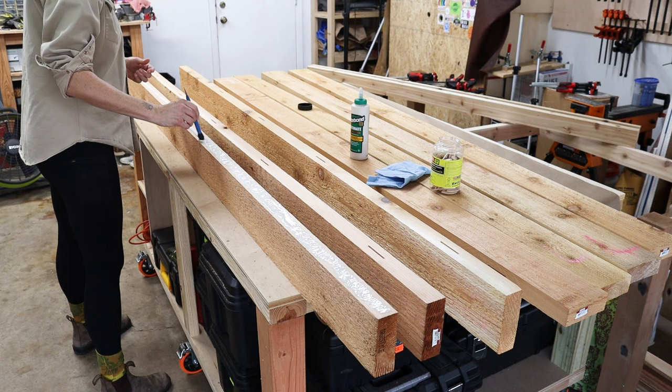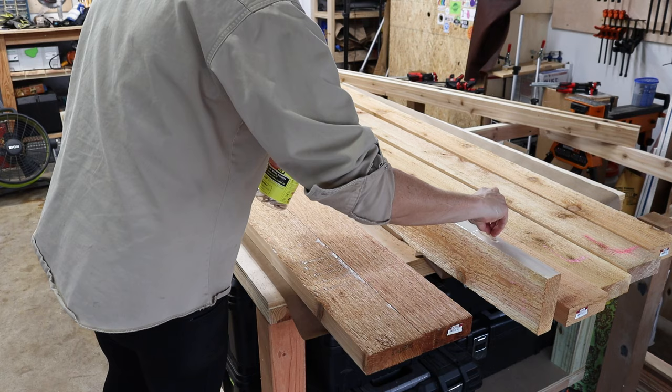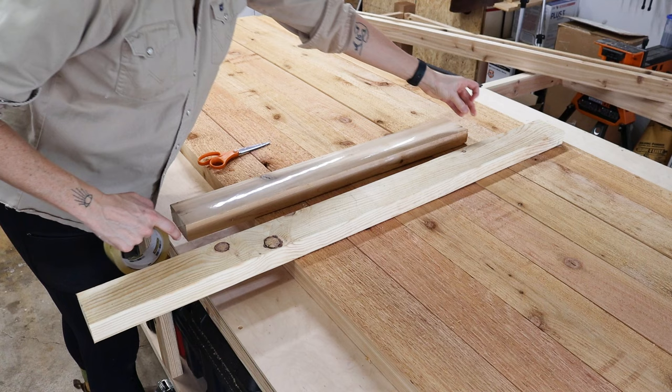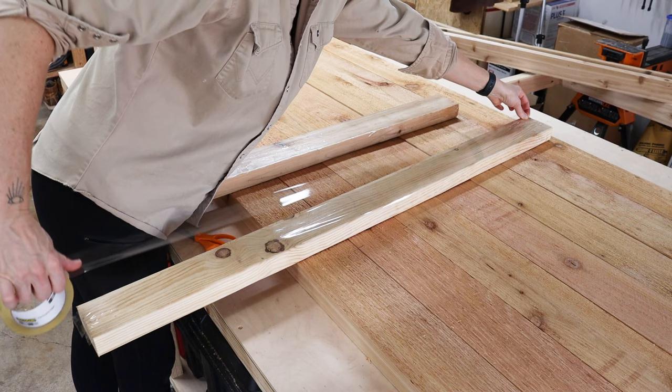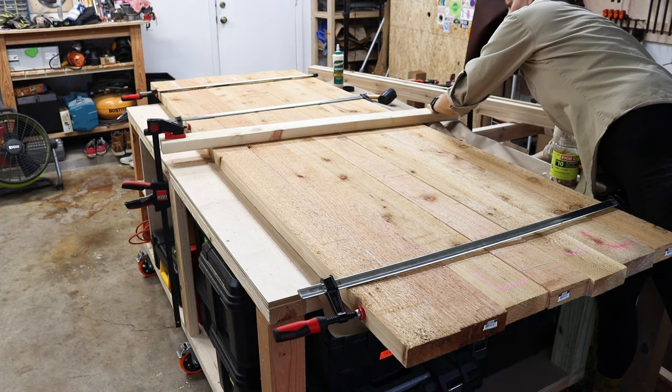I added wood glue on the edges and in the slots to help make the joining of the edges more accurate. Before the glue-up, I made some caul boards, which are just flat boards with packing tape on the contact faces so that glue squeeze-out doesn't stick to them — they help to keep the table flat during glue-up. Once all of the joints were together, I put the tabletop into clamps and left it to dry overnight.